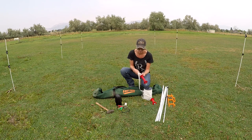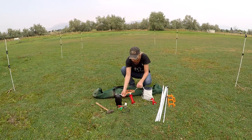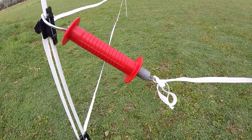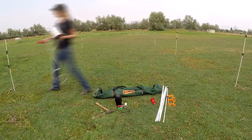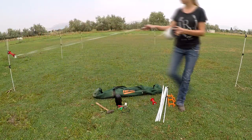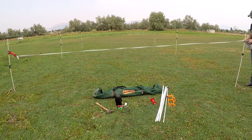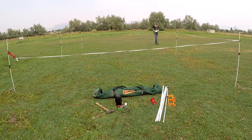Next, you tie the electric tape onto one of the gate handles. This doesn't have to be fancy — just any kind of knot that will stay put will work. What you don't want is a long tail hanging down that you or your horse could accidentally bump or brush by. Once it is tied on, set it by your first post or hang it, wherever you want your gate to be. Then start unrolling the spool until you get to the next post. Tuck the electric tape in between the top black clip. These clips are adjustable up and down the post. Proceed to the next post and repeat until you get back to the gate post.